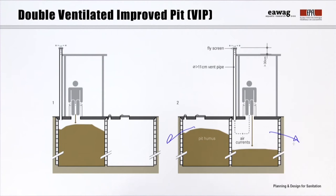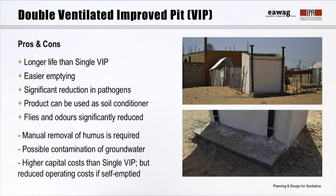The middle separating wall should be waterproof to avoid re-wetting of the resting material. Instead of being moved from one pit to the other, the superstructure may also extend over both pits, as shown in this photo. In this example from Mauritania, the superstructure is relatively big because there is also a bathing place in the middle, connected to a separate soak pit for the grey water. The picture below shows the two access covers for emptying.